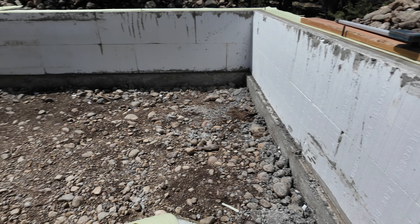Here's a close look at the progress we've made so far. Getting that first piece up there is always the hardest just because it's long and wobbly. We made some temporary two-by-four supports and used the laser on top to make sure it's going to be the same level as the plates on the end, so this thing is going to be nice and flat. We put temporary supports on the side to keep it from wobbling back and forth. We're cutting these so none of the joints are matching up.